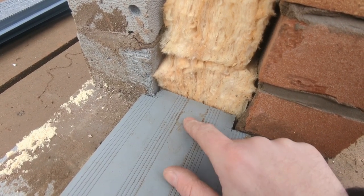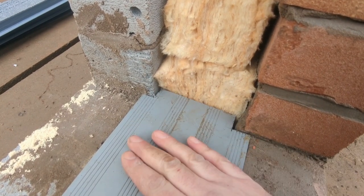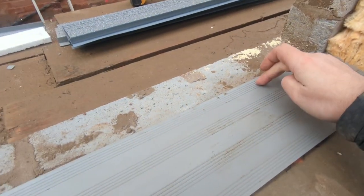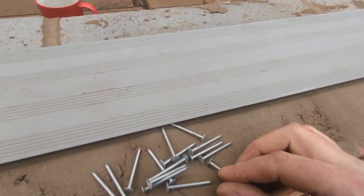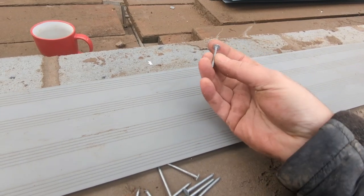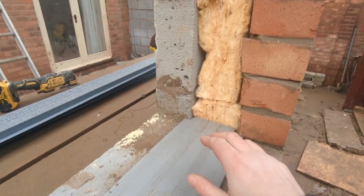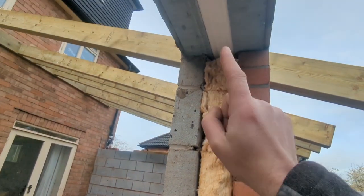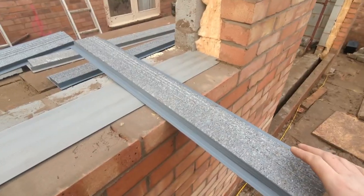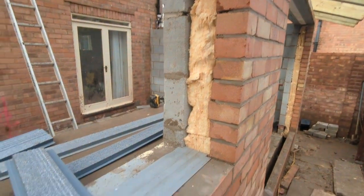I probably could have made that a little bit longer - maybe 80mm or 70mm instead of 50mm. But we made the effort. So that goes into the cavity. That then gets nailed on the blockwork side, just with clout nails - whatever you've got hanging around. Don't have to be that long but it's what I've got. I'm not going out to buy nails just for this. Then I'm going to measure from wherever that is to wherever the bottom lintel is and put that one in, which I'll show you now.